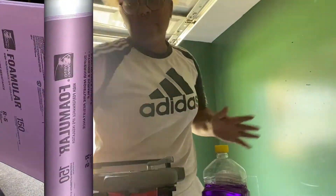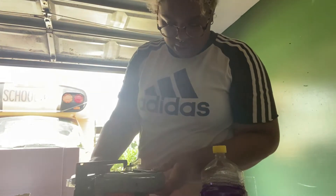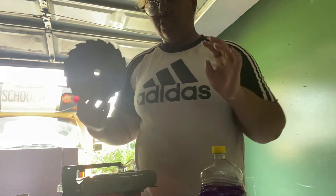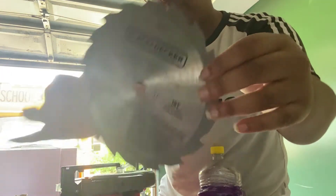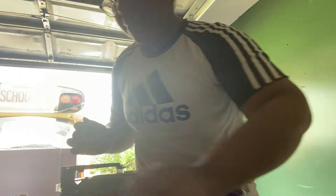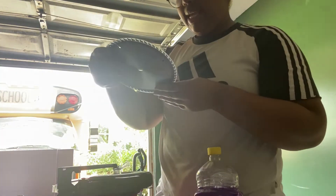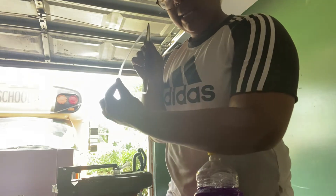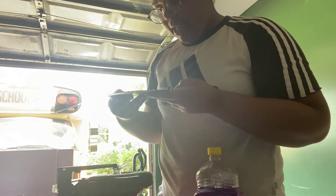I'm in my little workshop and I've never used a circular saw before, so I just looked up a YouTube video on how to get the blade out. It came with a blade — I'll put a link in the description for which circular saw I got, it's the Black and Decker. The included blade is a seven-and-one-fourth inch 18-tooth blade, but I wanted a more precise cut so I got a 60-tooth blade instead, which is what I saw other people using.